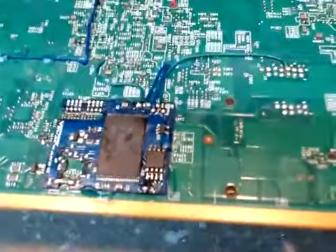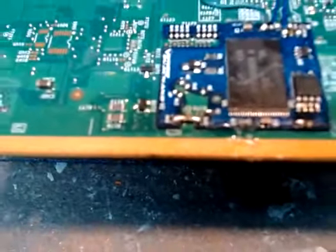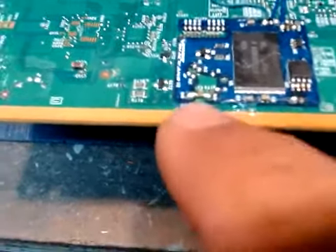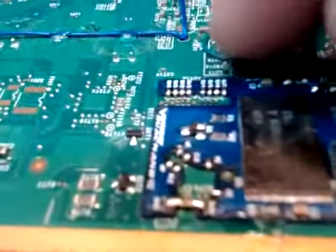What we did was go ahead and solder it in there. As you can see, you've got the little solder balls there for the NAND — all nice in a row, nice and shiny. And yes, it's a pin, and he has to do that. You've got ALE, RE, RB, WE, and all that, and then of course you got the power, which is taken from this resistor right here. Then you have your switch points: this one is for swapping your NAND, this one is for the LED, this one is for your SMC, and this one right here is RB. Those are the wire connections we had to do, and then of course we have to jump J1. So there's your wiring, all laid out nice and neat — looks like a little city grid, the way it should.